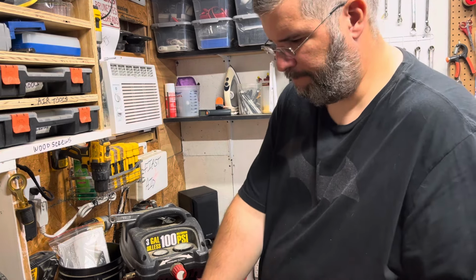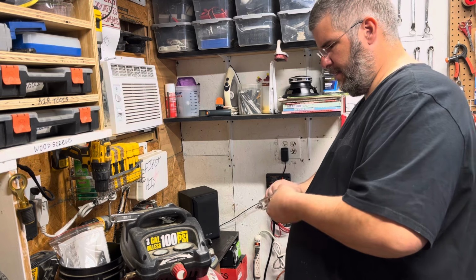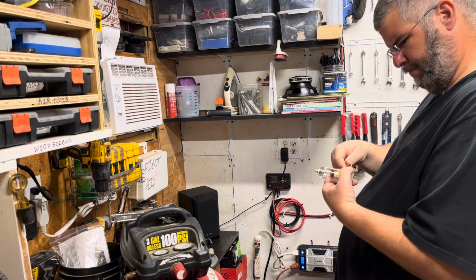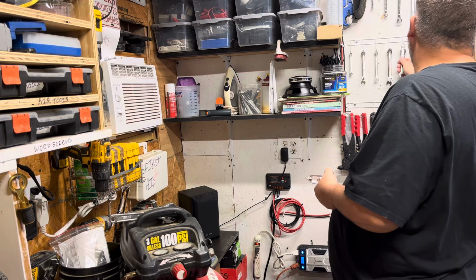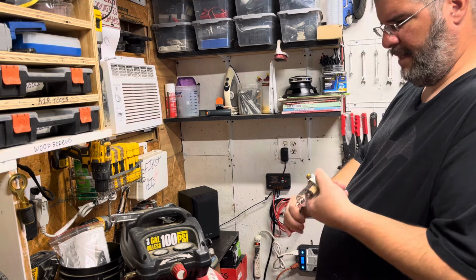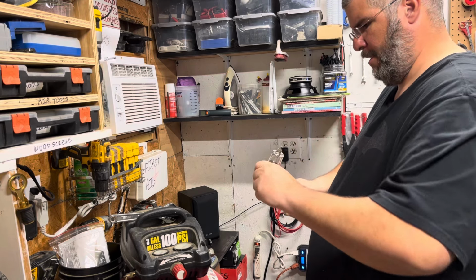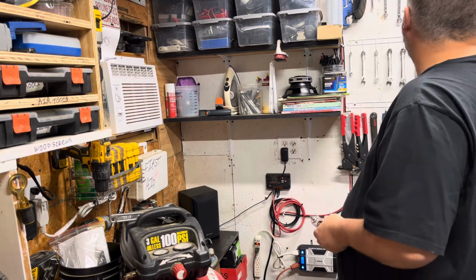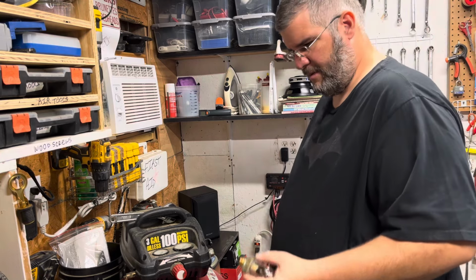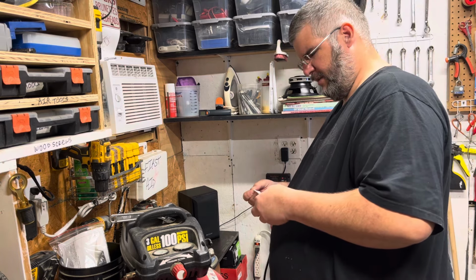Cut it in right. This sucker here. It's a lot smaller. I think it's either a 13 or a 14. Let's go 14. Not 14. Box end on the end of the wrench. Okay. Pull off the extra Teflon tape. Get another 2 or 3 inches on the opposite side. And then we're going to screw it into the regulator here.